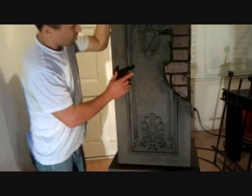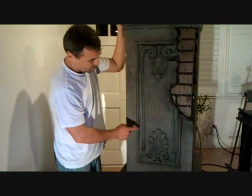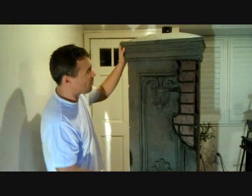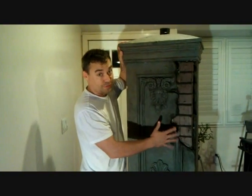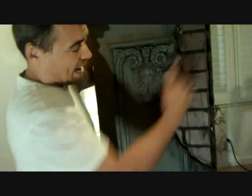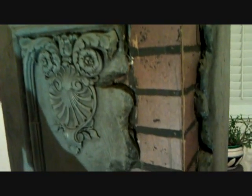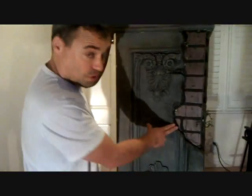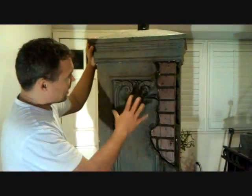As far as the only improvements we've done to it, just this last year, this was some decorative molding I had left over from a job and it's pretty uncanny how it just fit into the existing square that we had made. After I got all the sides nailed together, I wanted to create that edge that a lot of people use foam to do. I just took a Sawzall and hacked out the areas where I wanted the holes. And then I got this fake brick paneling that all of my other smaller columns are skinned with and mounted them from the inside, then put a piece of one-by behind it just to give it some support. I just took a grinder and ground some of these edges down to make it look like it's just busted. Then Gina came in and painted with black and kind of aged everything up.